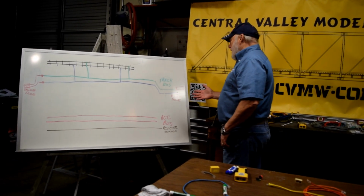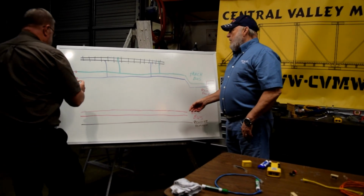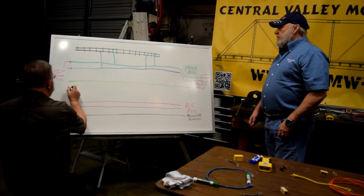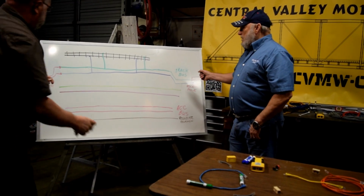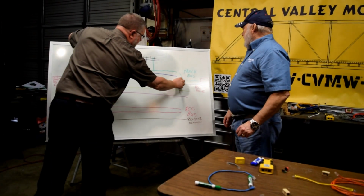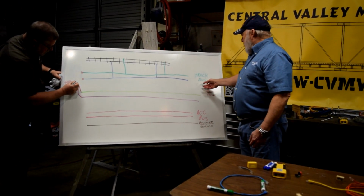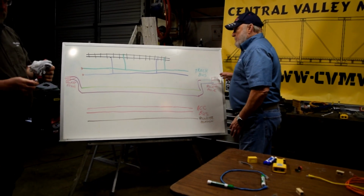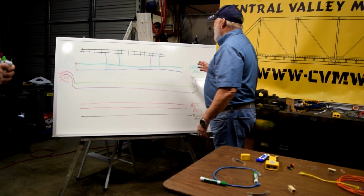And then we have the booster common that runs straight across the module with no ins, no outs, just the booster common wire. In order to implement MSS, we need to do two things. We need to add a second power bus that goes all the way end to end so that we can isolate the current that we're trying to detect from the normal flow, and we're also going to have to add an MSS signaling bus. In order to add the power bus, we basically isolate the bus on the current module by cutting both ends. We take the power pole modules and move those connections to the new bus that runs end to end on the module. So now we have the uninterrupted system power that runs from one end to the other end, and we have this isolated bus.